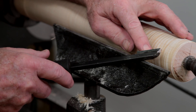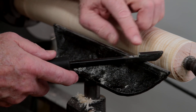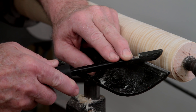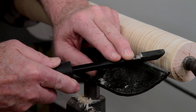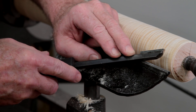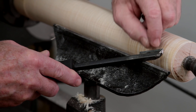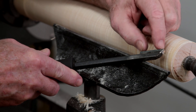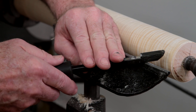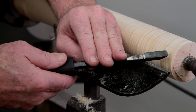On my mini Big Ugly like this — this is a square-shafted tool again — as is, it works fine flat on the tool rest. Kind of like the bigger one, if you start rolling it over on its edge, it gets a little bit off-balanced. Next time I make one of these for myself, I will actually cut this down a little bit, about an eighth of an inch or so, and then put the tantung in there. That just makes it a little bit better. I like shear scraping everything, so if I turn it over on its edge, it's going to be a little bit more well balanced.